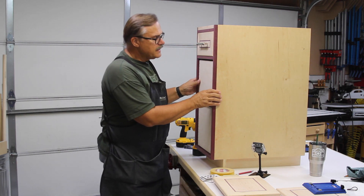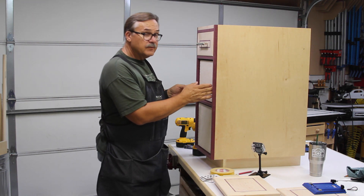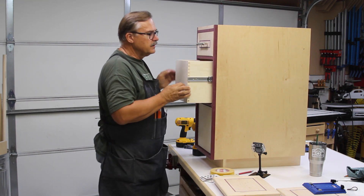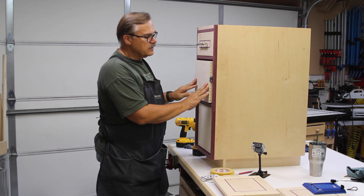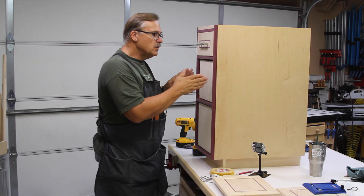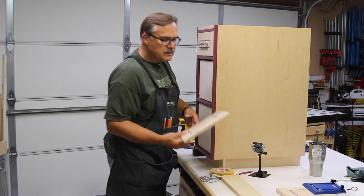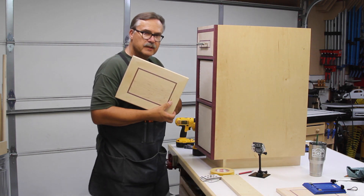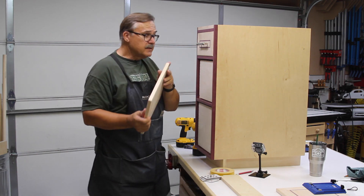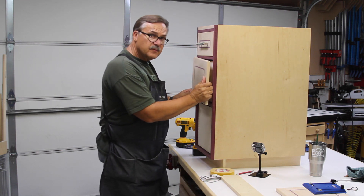When you put these drawers inside a cabinet you're subject to the size of your drawer slides and how that all fits in. Sometimes you just can't get it in there perfectly. So if this front part was made to size and the drawer hits the sides, making adjustments by moving around the drawer slides is rather difficult. One way we get around that is we make solid wood drawer fronts and attach them afterwards, so we can make them the size to fit the opening perfectly and make adjustments to get it to fit just right.